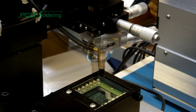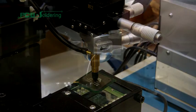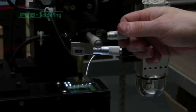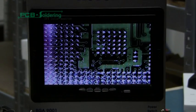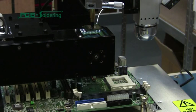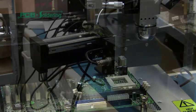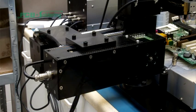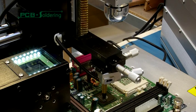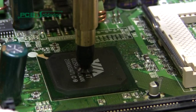Activate the suction tool and place the new or re-balled device under the nozzle. Move the station so that the chip is above the board and switch on the optimiser system and vision tray. Adjust until the component image is in the centre of the monitor. Adjust the upper and lower lights on the vision tray to achieve the desired split image for component placement. Once correctly positioned, roll down the adjust ladder until the component is approximately one millimetre from the PCB and depress the vacuum switch to release.